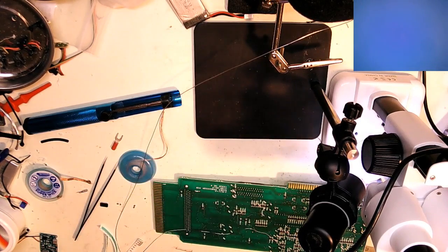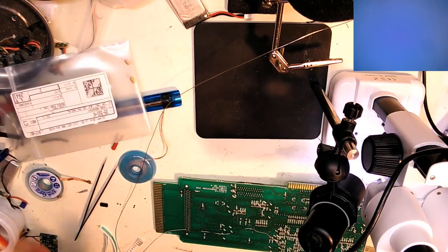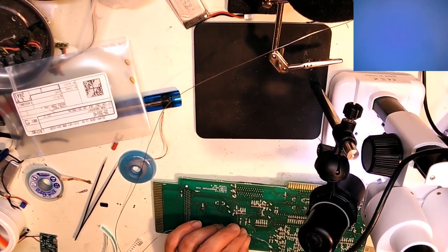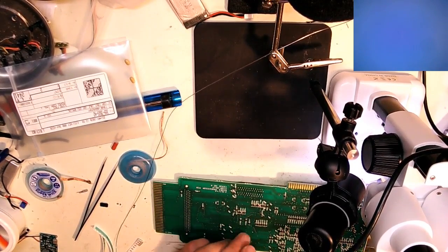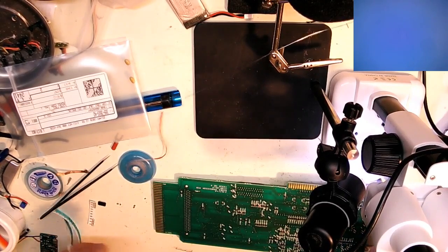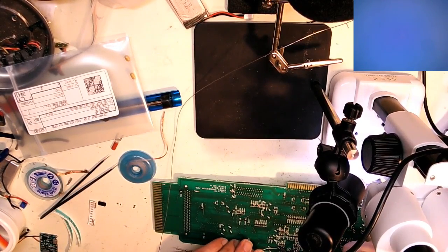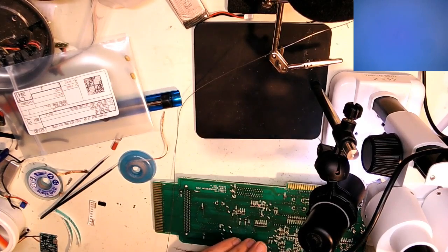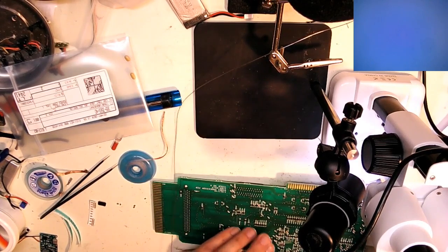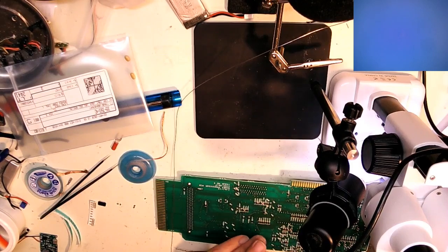These guys right here. I'll add a little extra solder to the pads real quick. Iron is set to 300C. I got all the other parts taken off the reel so I can actually work with them. That's the other one, C83. I'm gonna be doing most of this just by eye, so if I'm doing anything close, I'll throw it up on the camera. I do have my stereo microscope going on here too, in case I really need to get a good 3D view of it all.